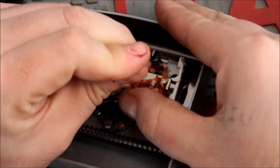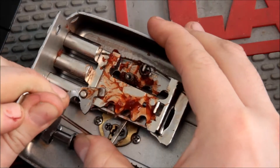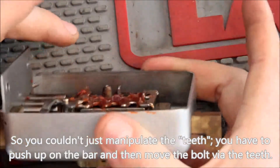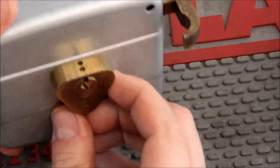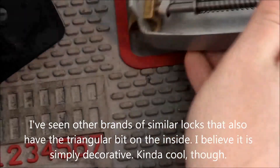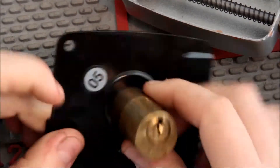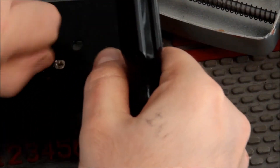As the cam passes through, it actuates the bolt and moves it one third of the travel. It's deadlocking — you have to push up on this bar to release the little teeth, and then it swings around one revolution. There's tons of grease in here. This outside cylinder appears to be kind of like a rim mortise — it's got two screws holding it in, and it's triangular, which is cool. The outside lock cylinder is also bolted in, and there's a little tail piece that engages with the cam bit built into this plate.